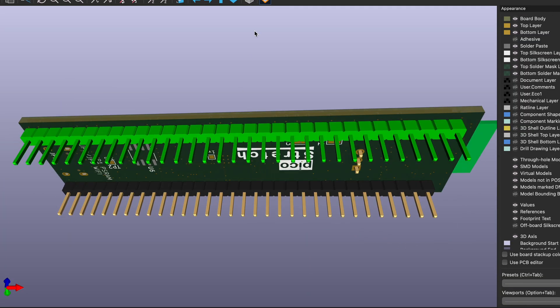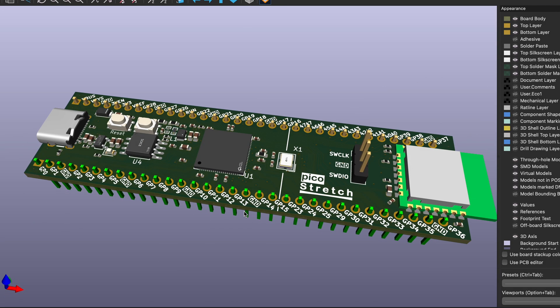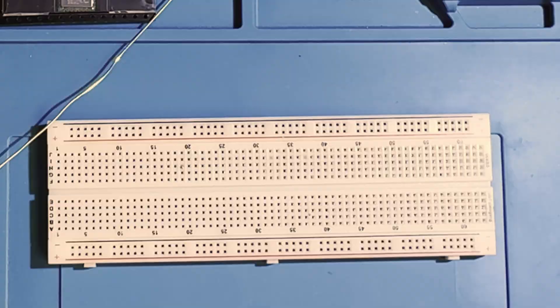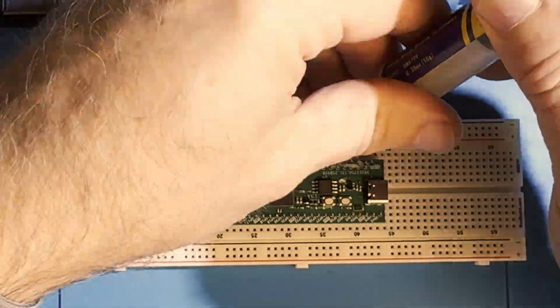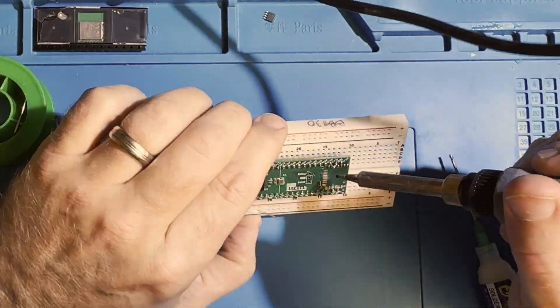I created small side wings where I run labels and traces. The board comes with pads for PS RAM and the Radio Module 2 — sources linked in the description. After I solder on pins and reflow the PS RAM and Radio Module 2, the board is ready for testing.